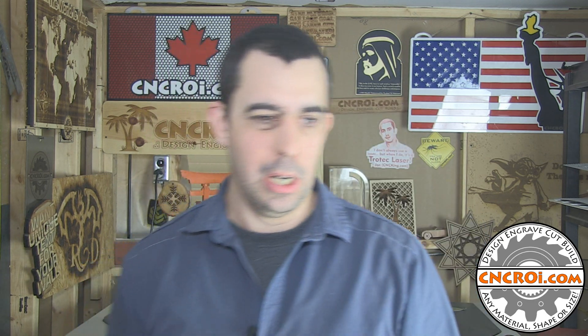Whenever I do projects where there's a lot of volume involved, I don't really care what the material of the jig is made of. I just have to make sure that the jig is flat, because if there's a little bit of warping, for the laser specifically, you end up with problems with the focusing — the results are based off the focusing cone. With UV printers it's a little different — you don't have a focusing cone, but you do have distance between the printer head and what you're UV printing. If that goes up or down 1 mil on a UV printer, I don't think it makes a difference, but it does make a difference for my laser. When I make custom jigs for UV printers, my spec isn't the UV printer spec — it's laser spec. And if it works great for the laser, it's going to be mind-blowing for a UV printer.